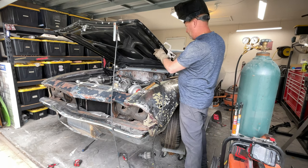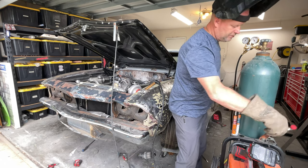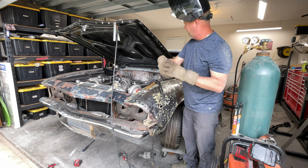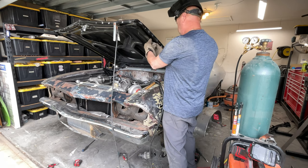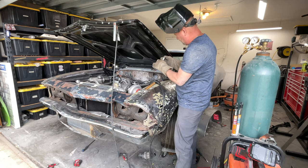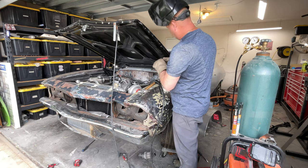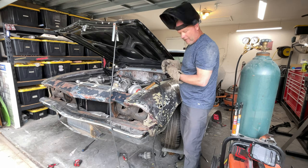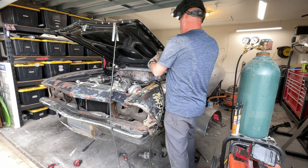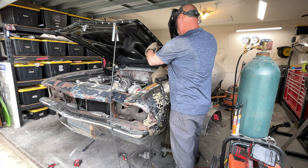So you're probably wondering, how are you going to weld that big old hole there? Well, I found this little tool right here and the thing works great. I think it was recommended by my ex-wife's husband, who is a professional welder. I told him how I was struggling with welding things and learning through it. I think this is either copper or brass - it's a backing plate. I'm probably just going to use this because I can kind of hold it in there and get just a couple of tacks here and there. And that's what I'll do.